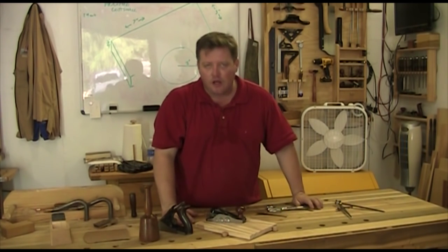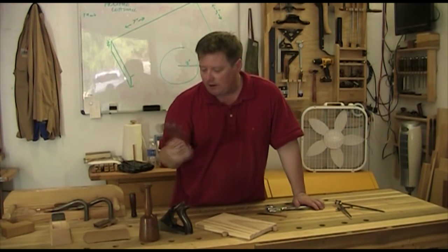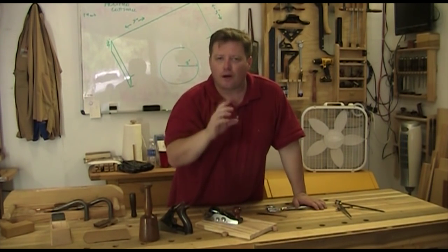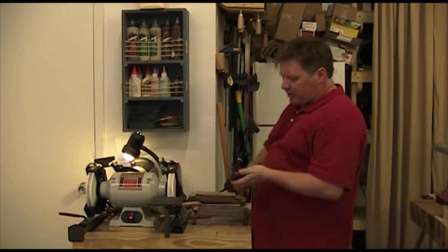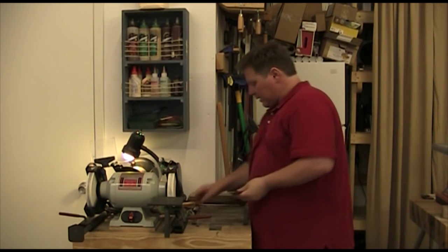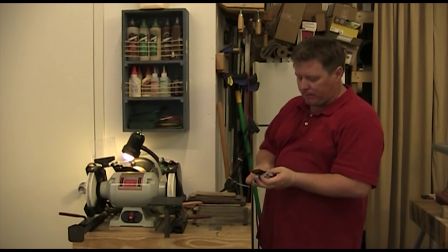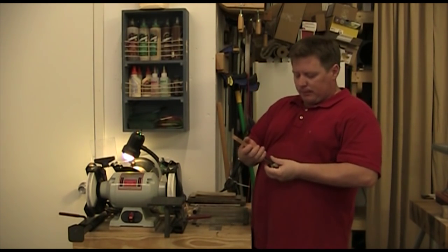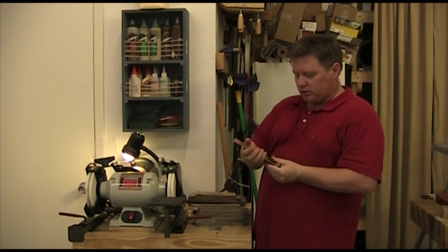Now how do you get a slight, minuscule camber into a blade? It's exceptionally easy — you don't have to do a lot of math with dividers. Let me go to the stones and show you how I add a camber to my block planes, my jointer blades, and my smoothing planes. Most people will add a camber to their smoothing blades and, as strange as it sounds, having that curve will make jointing a straight edge easier. Here I am at my sharpening station with a blade for a Norris-style smoother — a good example of wanting a slight, minuscule camber. I am going to use a standard inexpensive Taiwanese jig, a knock-off of the old Eclipse style sharpening jig. I am going to set it to 30 degrees by going 38 millimeters from the end.